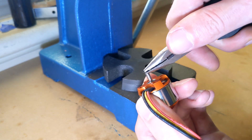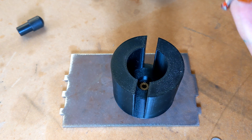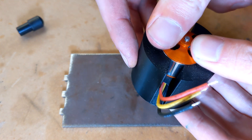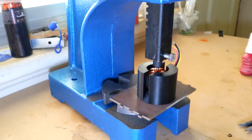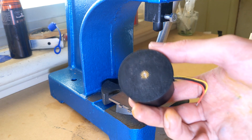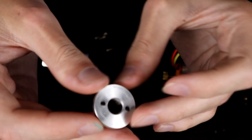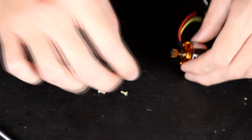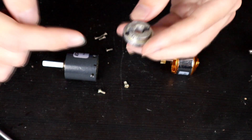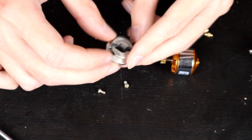Then pull off the circlip — I just use pliers for this. Next, sit a gear into the actual guide block and then the motor on top, and then press. If your press fit is too tight, you may end up with some gump on the bottom that you need to scrape off and then press again. But either way, you end up with a gear on a motor. From there the process is fairly simple — you literally just screw everything back together. I got lucky in this particular case because these gearboxes have slightly ovalled holes in the attachment plate and those line up very nicely with bolt holes on these motors, so these worked out pretty well.